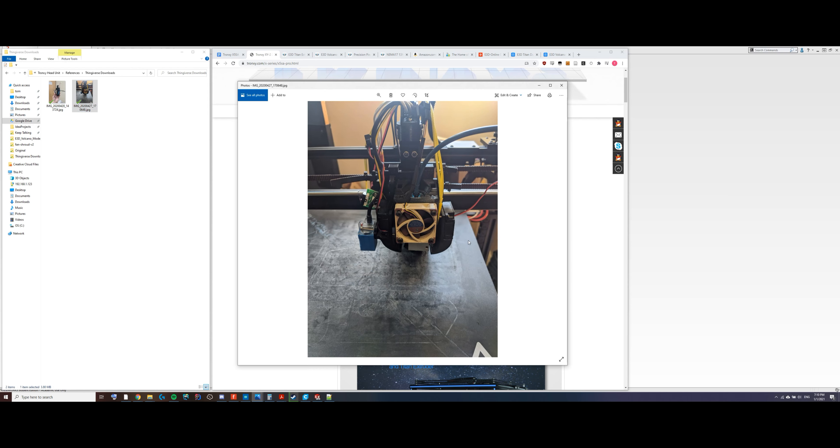Those fans also consequently don't put out that much air, which is probably why they're quiet. These little 30mm blowers are actually surprisingly strong. That whole thing is mounted on the backplane. Obviously it looks like I had some fitment issues. One of the things I didn't like was this Z-probe — this thing is terrible. It was so hard to get reliable and accurate measurements from it zeroing in on the bed. I later switched to a precision piezo. That fan didn't really push much air and I ended up having issues cooling the heat sink, and the PTFE tubing here indicates I was using indirect drive to feed the filament. I wasn't very happy with all of this, so I set out to redesign.